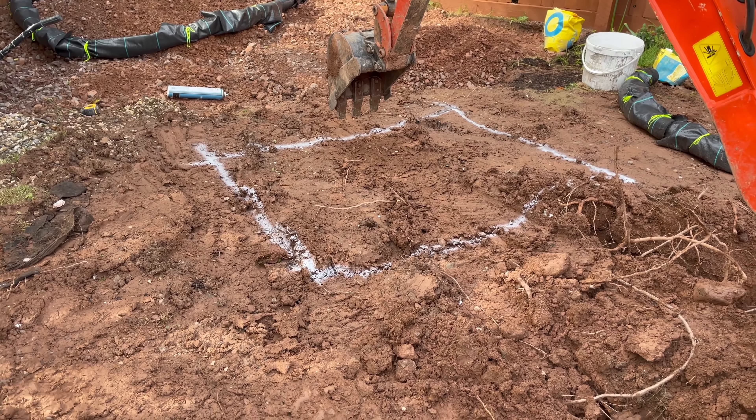We've got our walls in. We put a damp proof membrane up against the sleeper just to prolong its lifespan. There's the pipe, all wrapped up in the weed membrane. That comes all the way down here across the boggy bit and connects into the soak away. I've chucked a whole bag of chippings there to block the hole. We've got three pipes there — one, two, three — all in position. I've got two tons of chippings around the front to sling in the hole, and when that's done I can backfill this one as well. There's some spare hardcore over there to wang on top sometime in the future.